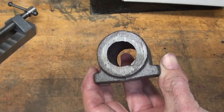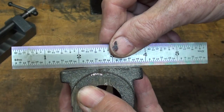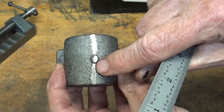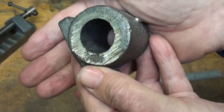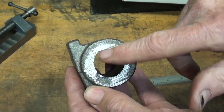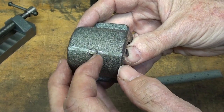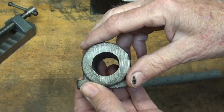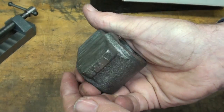What's the first thing to do on this? Well, nothing on a casting is square, because there's pattern draft. Even looking at the bottom here, you can see that it's tapered in two directions — that's called the draft. The reason for that is it needed to be able to be pulled out of the sand. And here's the parting line, so you know it was made like this. That hole was cored — a nice one-inch hole approximately, a little bit rough, but that's what you would expect. They've taken this and cleaned it — I think they call it snagging — to knock off all the flash. The gate came in here, this little boss up here is for the lifting eye, there'll be two mounting holes on each side, and four holes on each end to hold the end bells on.